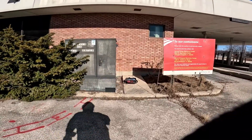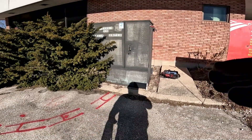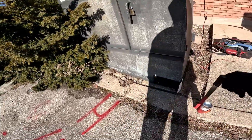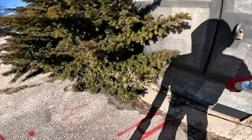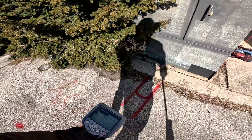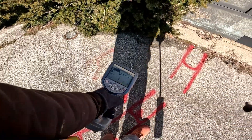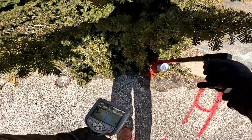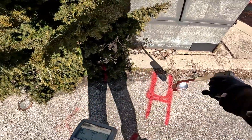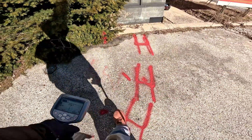It's always good when you get close, especially when you're hooked on to her — take it nice and easy. These transformers have grounds on all four corners, grounding out the whole transformer, so your tone might get shitty. My tone's getting kind of shitty; the arrows are pointing more this way because it's leading to a ground over here. So that's where you want to baby-step it to get as close as possible and mark accurately.